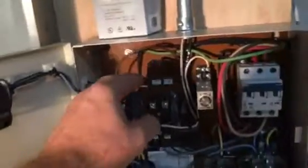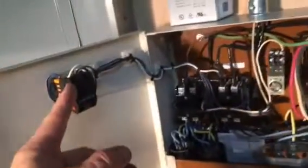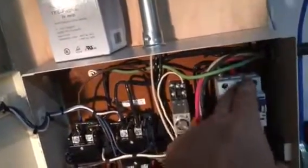For wiring, I've got my L1 and L2 coming in from my breaker, my main source. I'm coming through this disconnect here, which is all powered by the start/stop switch, and then I've got the L1 and L2 legs coming out and going over to the three-phase breaker.